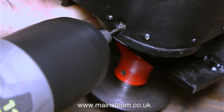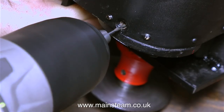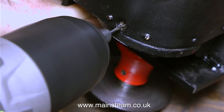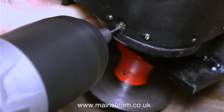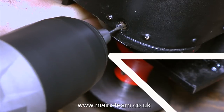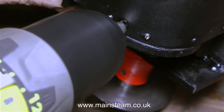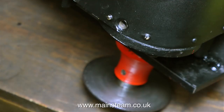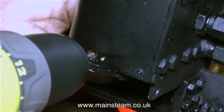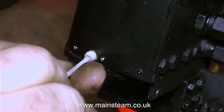I tried a piece of wire followed by a very fine drill. The only practical solution was to drill out the holes using a drill bit fitted in the electric drill. I've been very careful with this because if the drill snaps off then I really do have a problem. Yes, I know I'm drilling a hole into a cylinder where there's a piston — I've obviously moved the piston out of the way. The first steam that gets into the cylinder will blow out all the metal particles. Plus, before I fit the drain cocks I'm going to run the engine up and down the bench while pumping lots of oil into the cylinder to flush out these particles of metal.